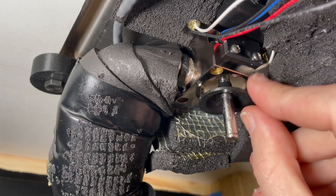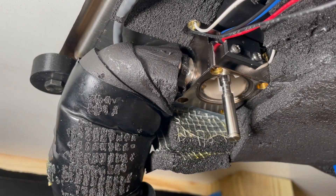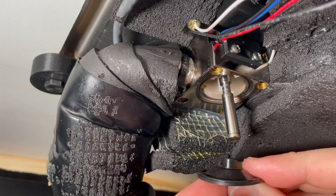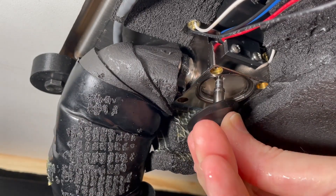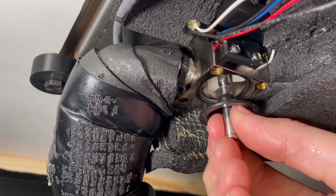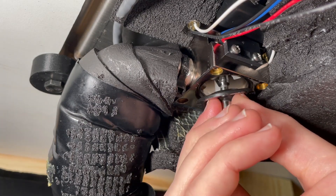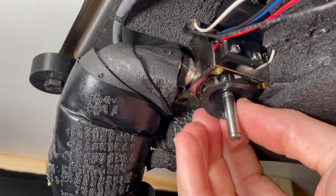Now that we've found the obstruction, we need to take off this old diaphragm and replace it with a new one. Since we're already here, might as well do it. Just make sure the nipple on this is sticking up. Push it up like that, and see how it's kind of umbrellaed up — we'll make sure it's pulled back down. There's a little notch right in the center of that plunger head and the diaphragm sits in. Make sure it's in there, snug in place.